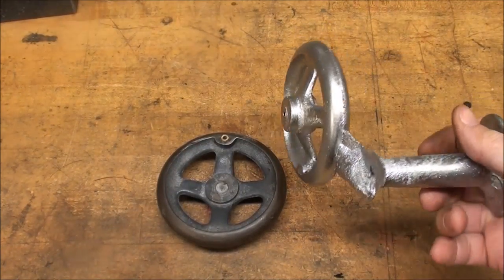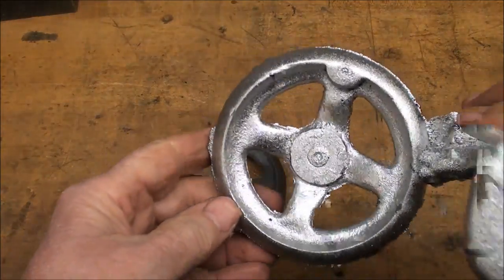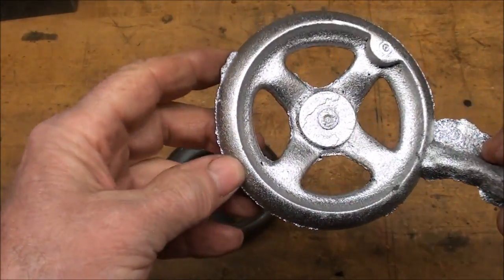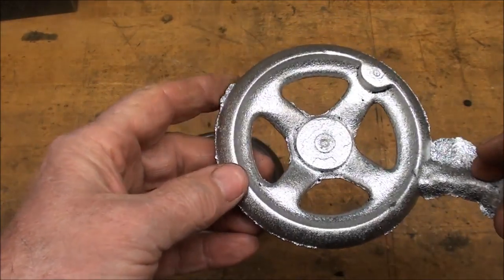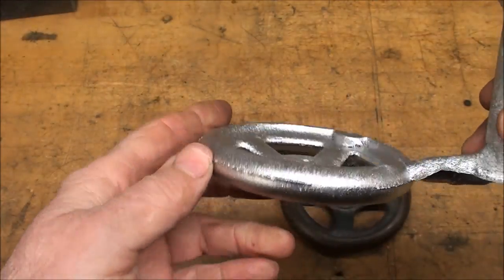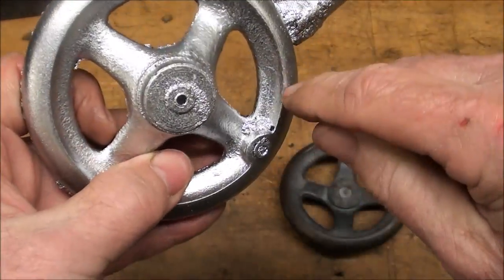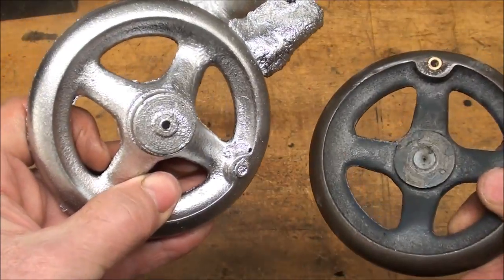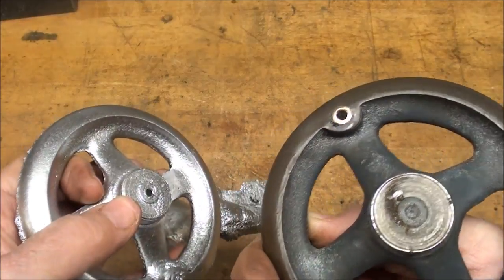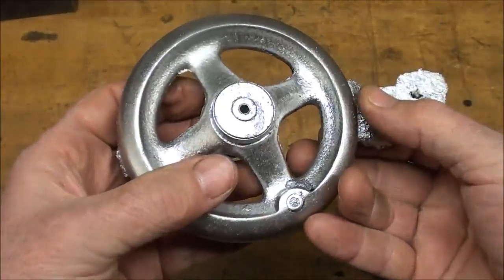The mold has been poured, and here's the finished casting — I'm back down in the basement. We'll look for a few defects here; I'll be critical. Remember that a casting is never quite as good as the original, especially when I'm making a casting from a casting. This is the spot where the sand stuck to the pattern. And that's going to be on the inside, so it won't show up anyway, so I'm not going to throw it away for that.